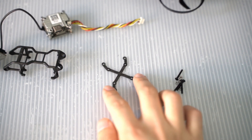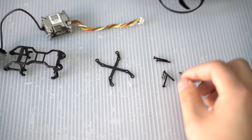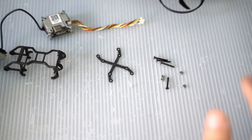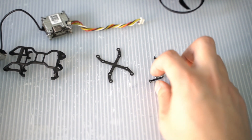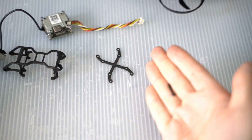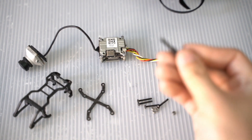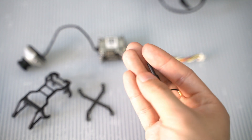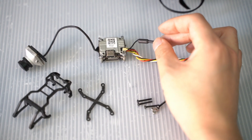Alongside the mounting bracket, it also comes with the screws — and I want to make a point of this because I actually tried to use my own M2 screws while mounting the Caddx Vista, but it doesn't really work out because the tolerances are really, really small. There's not a lot of room in here to fit bigger screws, so you pretty much have to use these specific included M2 screws. Also, you'll need an antenna — I'm just using one of the included antennas. They include two for the O3 air unit, so I'm taking one and it fits perfectly onto the Caddx Vista's UFL connector.